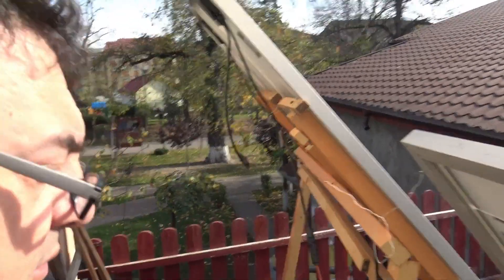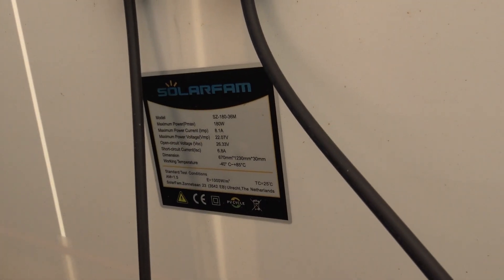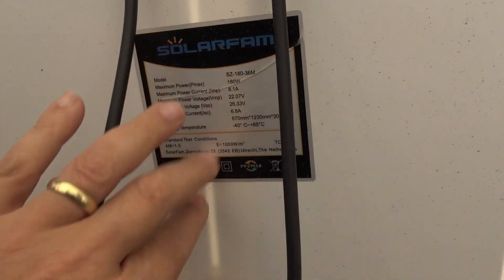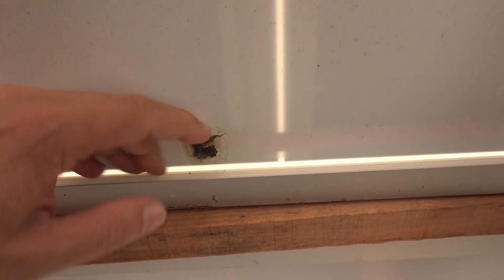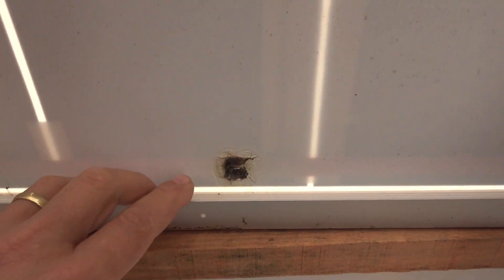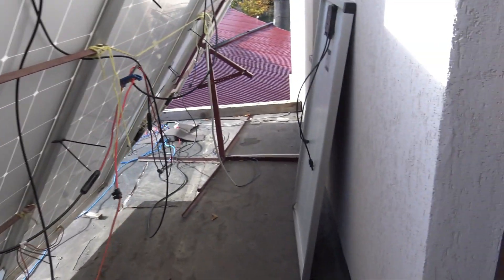This particular panel is made by Solar Farm, or I don't know how it's commercialized. That's not a crack here, it's just the label. But let me show you what's happening — one of the connections from one of the cells got really really hot and even broke the plastic behind it.